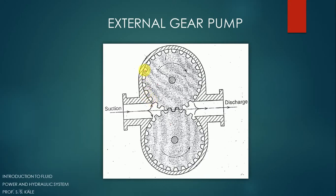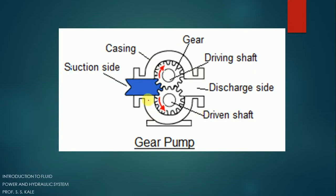This oil comes around and gets discharged at the output. The oil moves forward through both spur gears — the gap between each gear and the casing carries the oil and it gets discharged at the output. This is the simple working of the external gear pump. There are some stages; I will show a figure which will make this more clear.